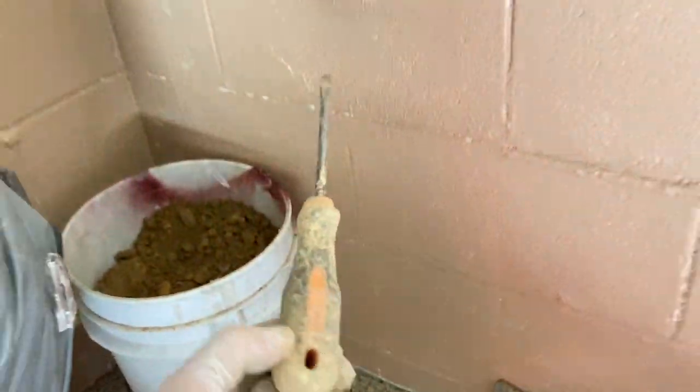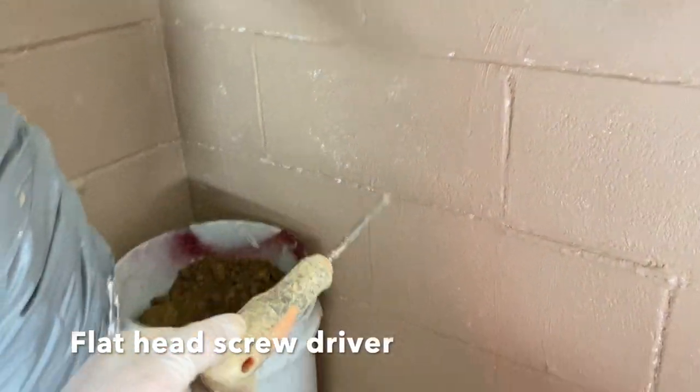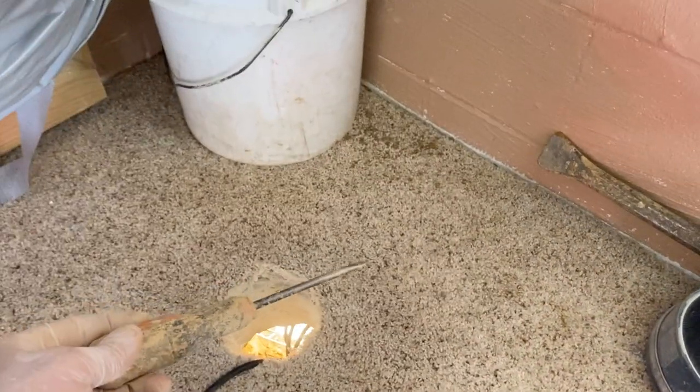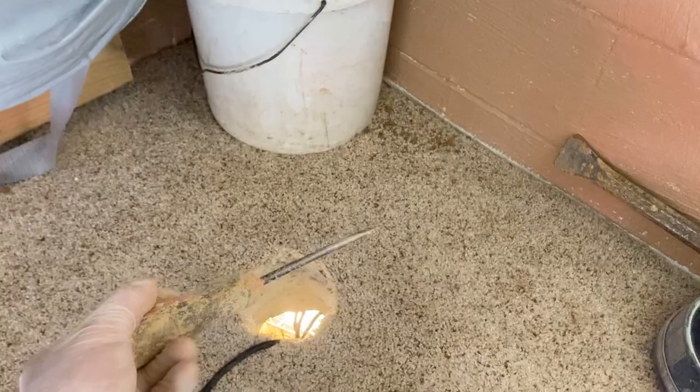There's very little gravel here — that's just the way the ball bounced today. I wanted to show you what these suction pits look like inside, because some situations are better than others. Here are some tools of the trade: we've got the core drill, the digging bar, and this right here is where we make the most headway. You get your most airflow by going this way, underneath the slab, working it like that.